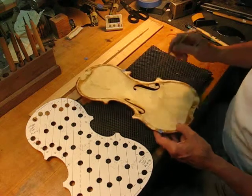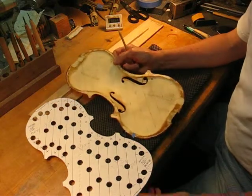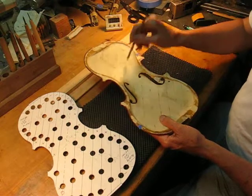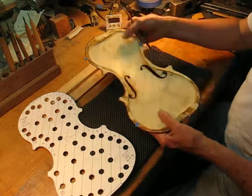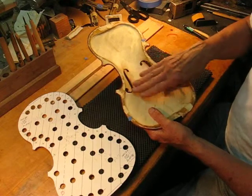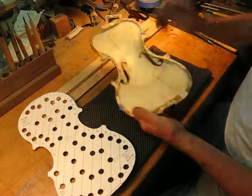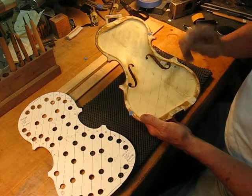So this is the next strip we're going to do. These tone strips — it seems odd — Mr. Dorczyk discovered this after years of labor. Our goal is basically to have our plate graduation ideally at about 2.6 millimeters, but you've got to work with what you've got. If it's too much, re-graduate it. The edges and the ends are the full 4 millimeters — the glue contact areas — and this goes all the way across for strength. Guarneri and Strad did it that way, and so will we.